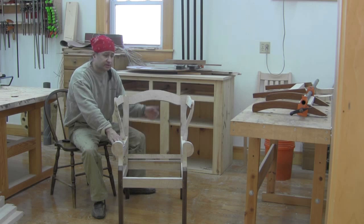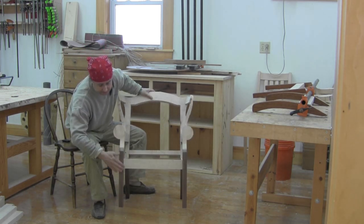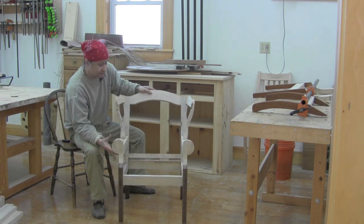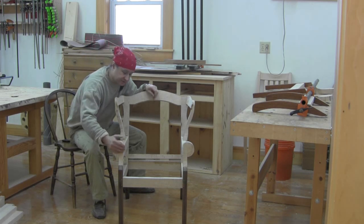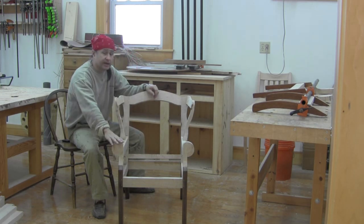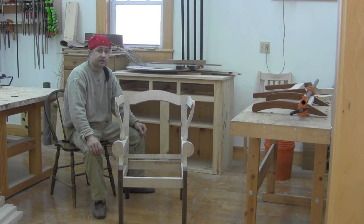This particular chair here, I would just like to say that this is a good representation of how I build my chairs. I use 1 1/4 inch thick soft maple for the frames. All the exposed wood, like in this case we have a walnut, is done with the actual wood of the customer's choice. I prefer to use real wood instead of staining. As you saw in the video, all the structural joints are peg, mortise, and tenon. Finish is a hand rub, wax and oil finish, and we sign and date all of our pieces.